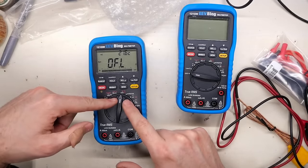This is so much better suited to finding those shorted tantalums than this. It still works. Like, you might have like 0.41 and 0.43, you know, with another cap. But sometimes if they're really close together on the PCB, you need additional digits, and this one can do it. But yeah, you saw what was happening there. The resistance was sort of floating all over the place until I hit it.